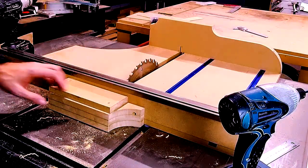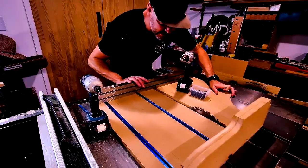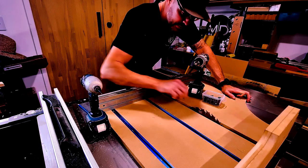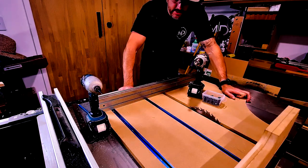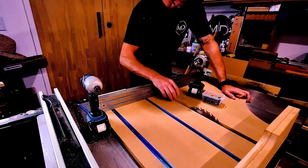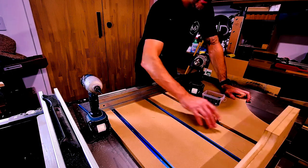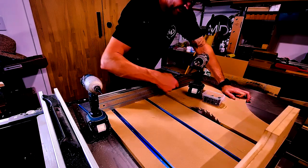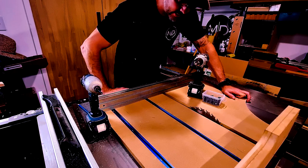For this next section, I previously only cut up about 20mm for the five-cut plywood test. Now I need to cut up to about 50mm to cover the full stock height, so I'm setting the blade to 50mm and cutting the guide slot through both front and rear stocks. I've got the old blade on so I can go through the aluminium very slowly and carefully.